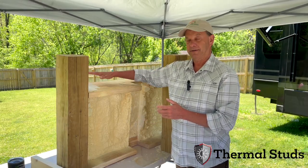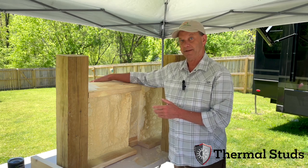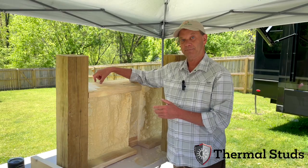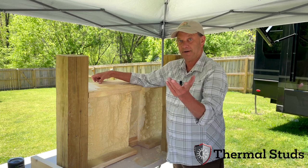This panel right here, we can have these manufactured already. On the outside is a drain strip, a rain screen product. There's a water resistive barrier. There's a 100% thermal break, so an R10 outboard. There's actually an R10 inboard, so you get an R20 right away, or whatever you want.